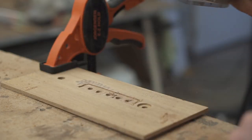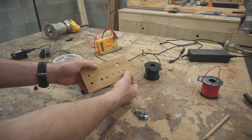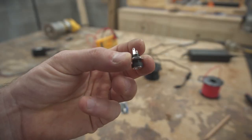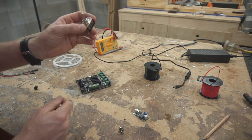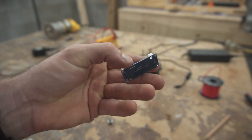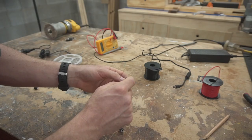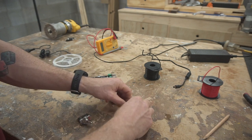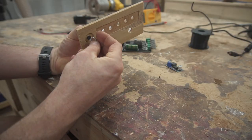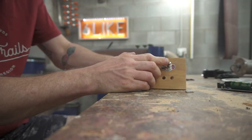I ended up making some adjustments to this plate — I just didn't like the positioning and I wanted to make it a bit more compact. So we're going to have the dials from the amplifier over here, the main power switch over here — that's your power in and then that's your auxiliary in. Flipping this switch will run power to the board, the amplifier, as well as this LM2596 which is going to take the voltage from 24 volts down to 12 so that I can connect to one of these rolls of LED lights. Those are going to sit on the inside, and once I'm happy that that's all working then we can get it all together and into the box.